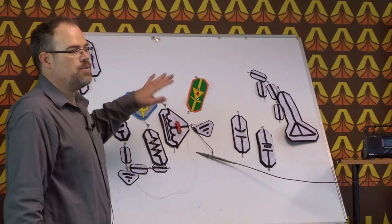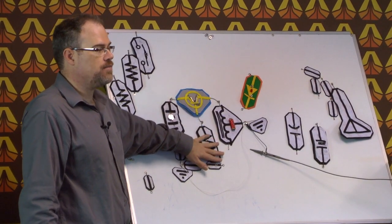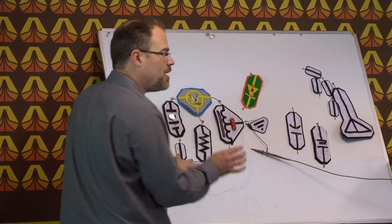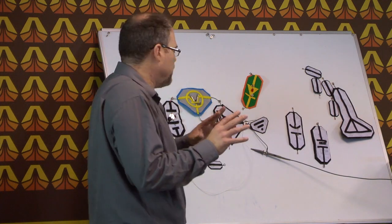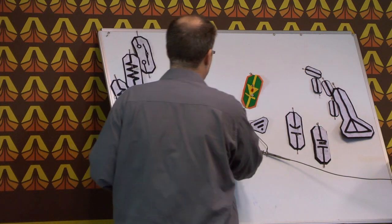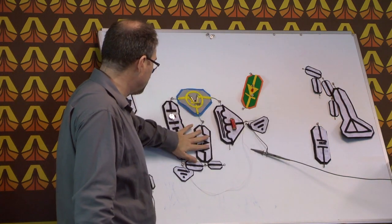So again, with a transistor, we need to get it past its sleep stage. We've got to wake it up. And to wake it up, we're going to need to get it about 0.7 volts, a little bit of current, and that's this resistor. It doesn't do very much, but it does wake it up and get it just to the point where it's almost on, just a little bit on. And when it's there, it's very easy to make it go more or less on. And we need that because we're not creating a lot of signal. OK, so now we have a battery, we have a transistor, we have a resistor.